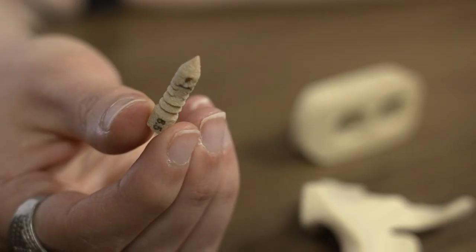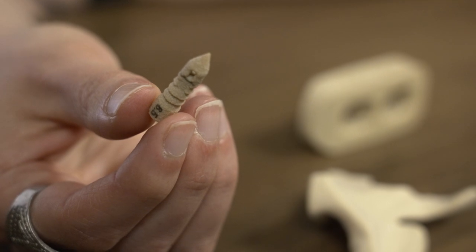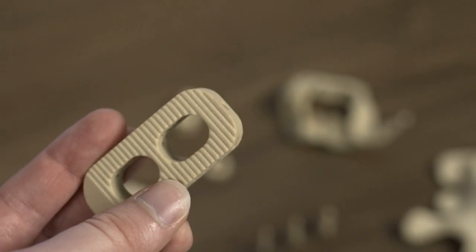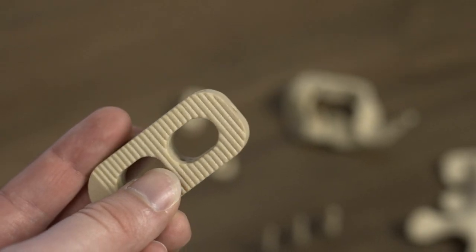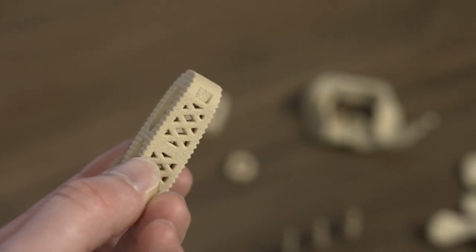Okay, so PEKK in suture anchors gives you all this great stuff. The material wants to stress and move in ways that are similar to the way human bone stresses and moves. And bone really wants to grow into this rough surface. Plus, bugs don't grow on it. It is demonstrably resistant to bacteria. All those benefits are there. And then the other part of the story is 3D printing allows these benefits to be realized in a cost-effective way.